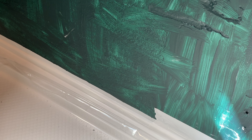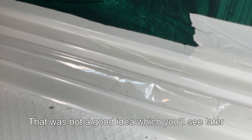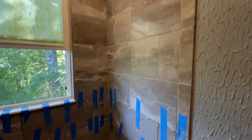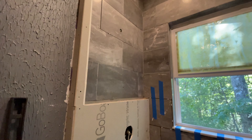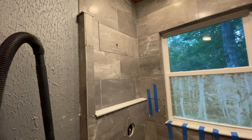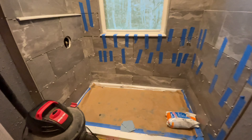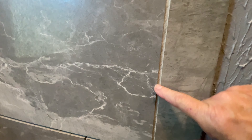I'll put the tiles out in front, building out with a lot of mortar there. This is after I've got two walls done with the same tile. I started from the top down and taped it in place so it wouldn't sag or fall, and used little separators for consistent grout lines. That turned out really well. I dug out the grout lines with mortar because the original is light gray and we want to match that.